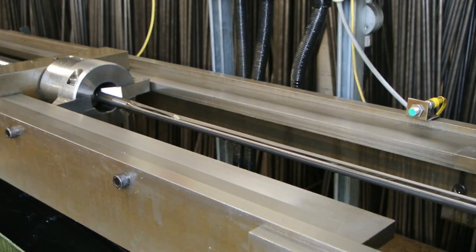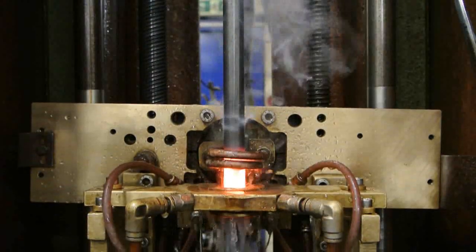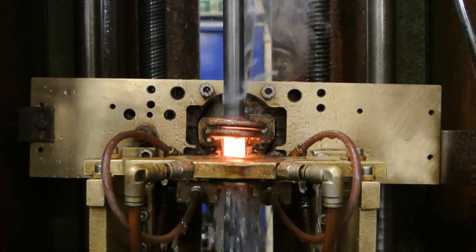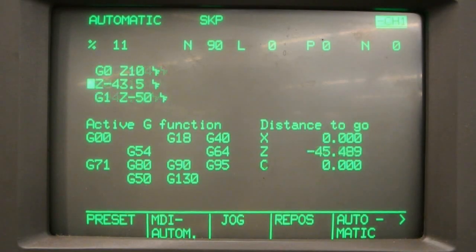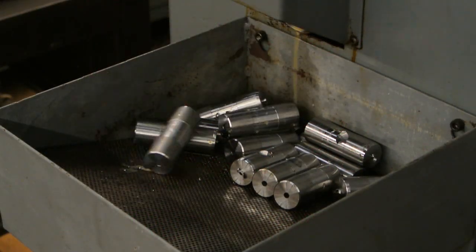Hammond & Co have invested heavily into producing perfectly uniformed tubular shanks, which are hardened using purpose-built induction machines. Drivers are mass produced on CNC lathes to suit all tube diameters. Drivers have a flat, fixed with a reduced waist for locking in place in a machine spindle.